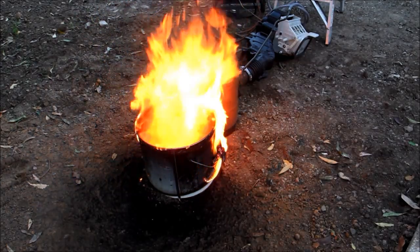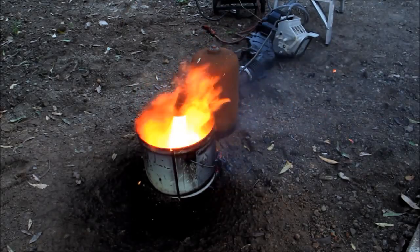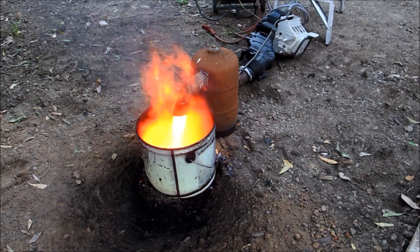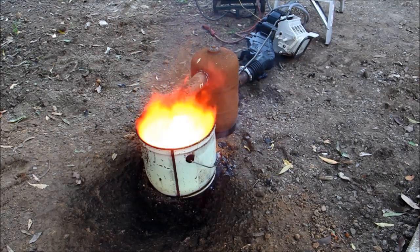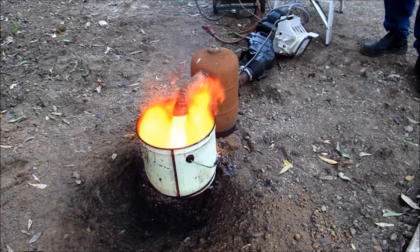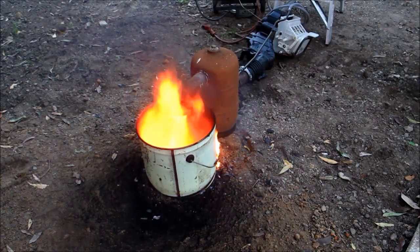The blower was a little bit low-powered and that helped cause the pulsing, and also I had a little bit too much turn on the inlet, which was rectified by welding in a piece of flat pipe in front of it — which slowed the swirl down and improved the mixing of the air. The main thing to keep in mind is not how big the inlets, outlets, and bottle are, but just basically making sure that you keep enough heat in the burner itself so the oil is vaporized.